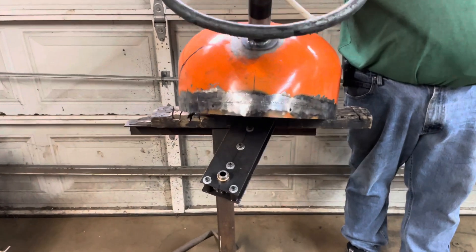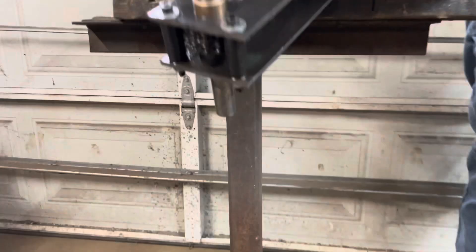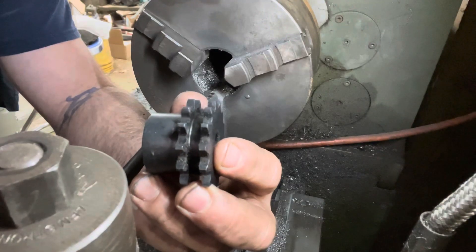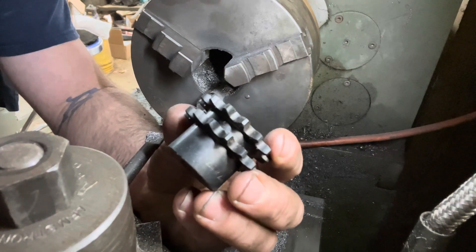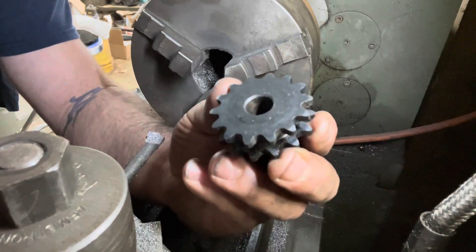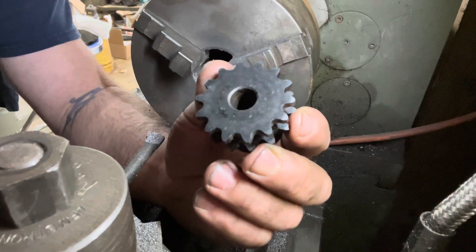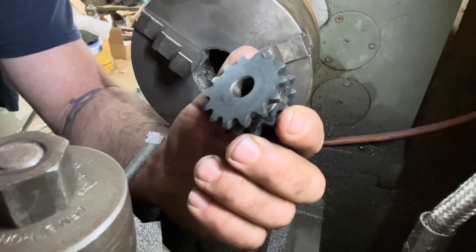This is how we made clearance for that steering shaft. We made a chain drive steering offset at a one-to-one ratio. To make this steering offset, we need two double chain sprockets, but they come with a bore for a half-inch shaft. They're machinable up to three-quarters of an inch, so we're going to bore them out to three-quarters and start the process of making this offset.